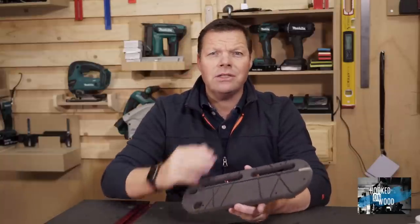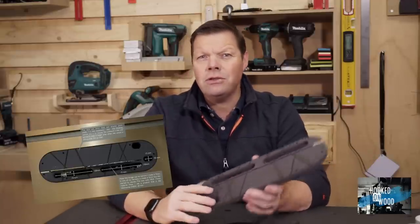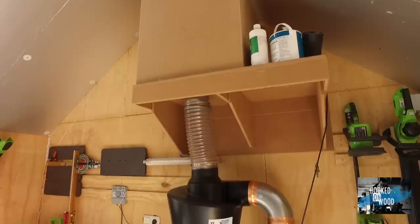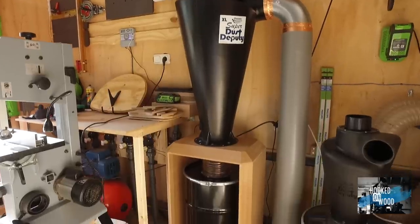If you have watched the old version, I think it is still interesting to watch this one, because I dig a little bit deeper and show you the dimensions of this Zero Clearance Insert and how I made it. When I got a new table saw, I had a problem of underpowered dust extraction, so I needed to upgrade it. I ended up with a 2 horsepower dust extractor, a new and big cyclone, and I increased my duct system from 4 to 6 inches and the inlet of my table saw from 4 to 5 inches. But at the end I was not completely satisfied with the results, so I began to think about a way to make it better.